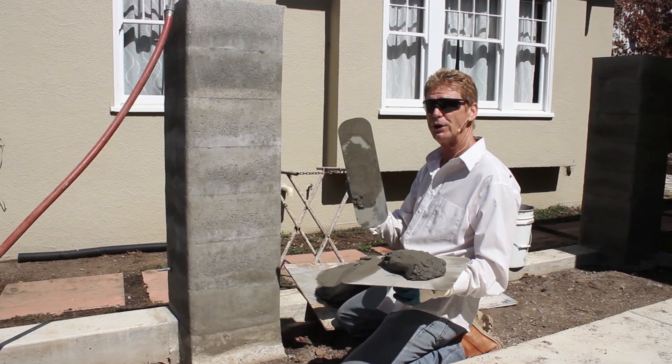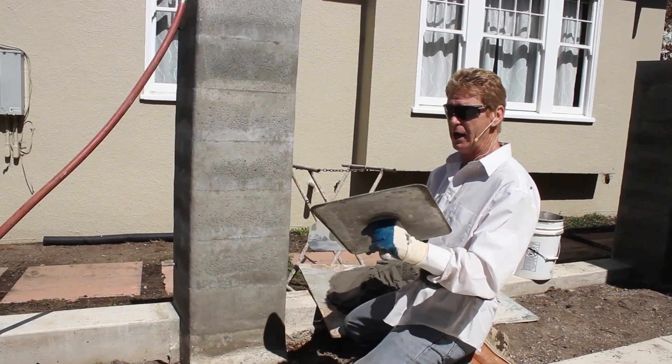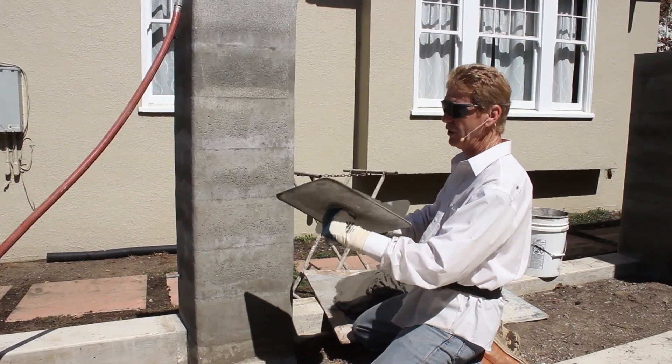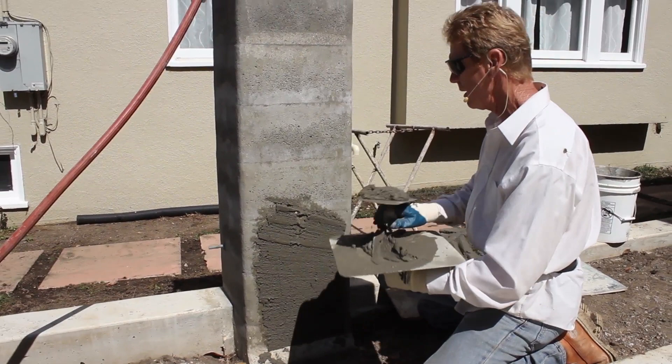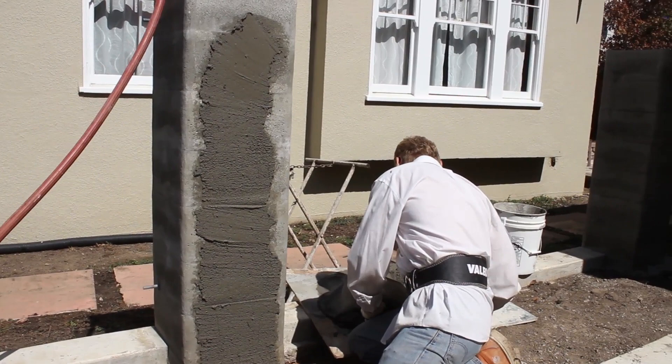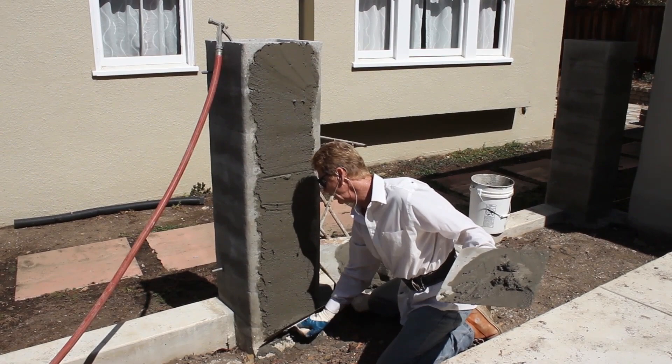What we're doing here is we're going to skim this. The best way to skim it is — again — put lime in your plaster. Remember that old song, 'put the lime in the coconut'? Put the lime in the plaster and it'll help it stick better. Watch this. You get a rock, throw it out. For us, we want to skim it — we'll get that corner in a minute. First, we skim coat everything, then we get our corners after we get our middles.